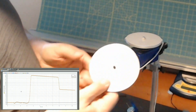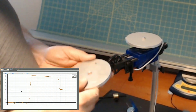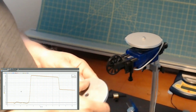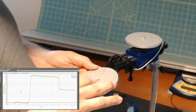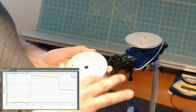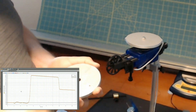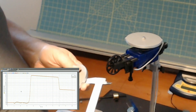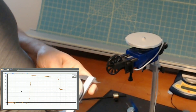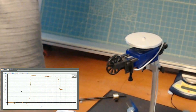What do you compare it to? Well, this is a standard geometry and there are formulas to calculate these — you can look them up, Wikipedia is your friend. This is a disk, so it's going to be one-half mR squared with the radius. The radius is included in the file — it was measured with a caliper. The mass is also in the file.